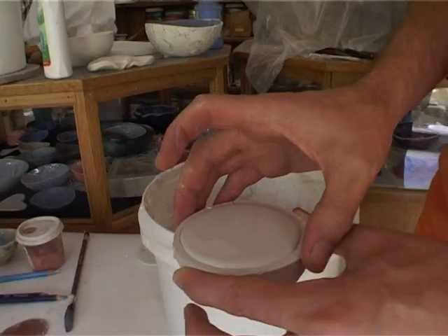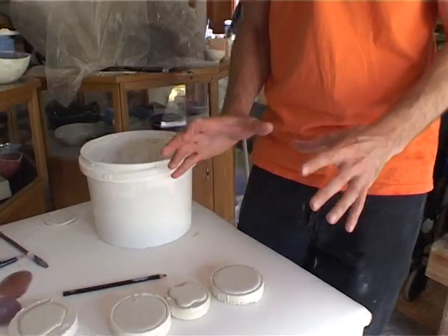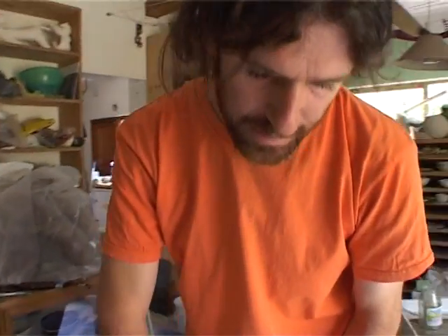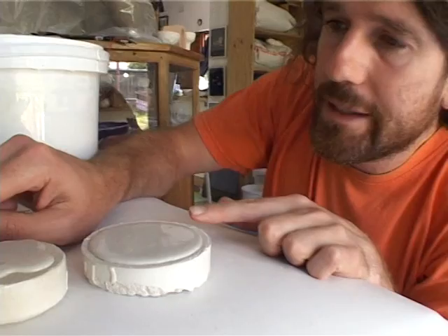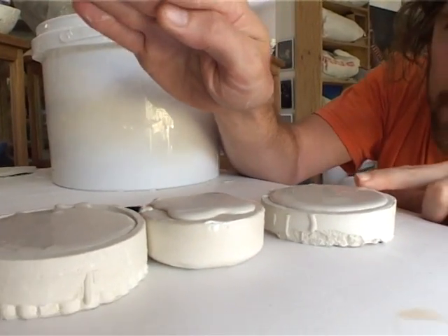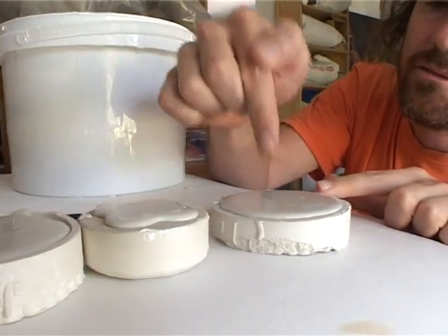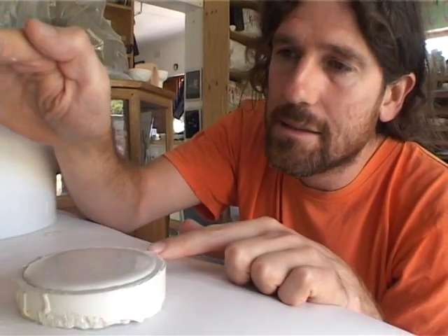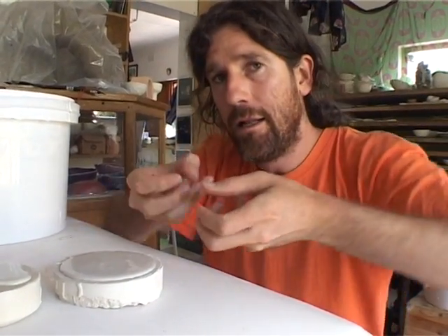I like that. Place it carefully. That's a nice amount. It's using the meniscus — the surface tension — and as you can see, this one here has settled down. It's kind of like baking, but this one here would have been as full as that, and as time goes by it settles down. All the particles compact into position, they lift all that detail up, and you get one of these.